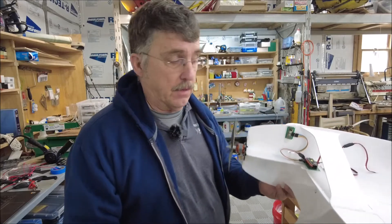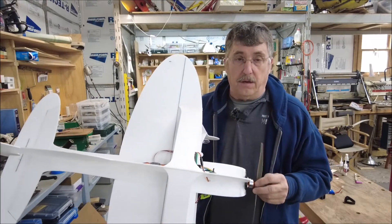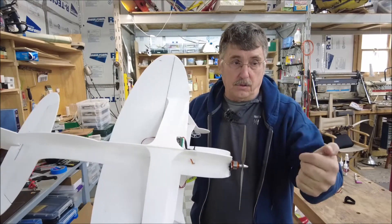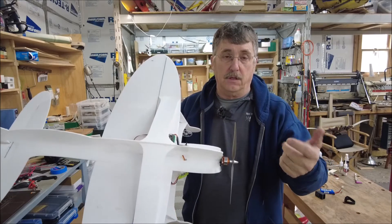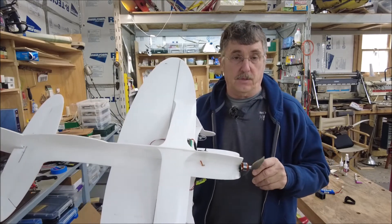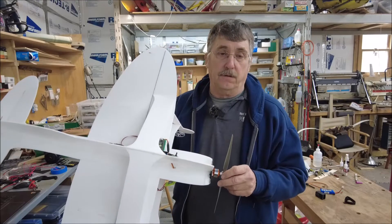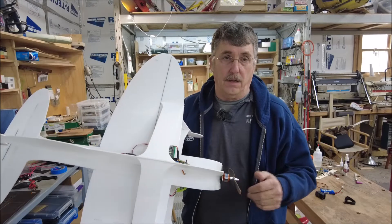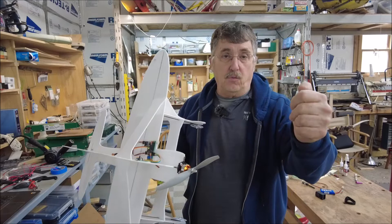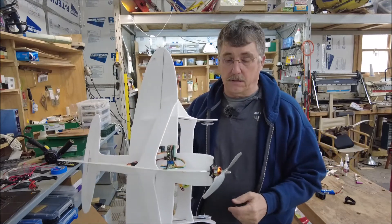Today I can't adjust the attitude gain because it's not part of this logic yet. I have some printed circuit boards being made, and they will include the attitude gain. They'll also include the ability to terminate the flight with a key fob. I've been releasing key fobs with two buttons, but I bought some with four buttons, which gives us flexibility to do things like start and stop the motor. In the future it's going to be start-stop, and then I have plans to integrate in-flight adjustment of trims, the climb-dive gains, and the power gain.